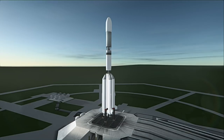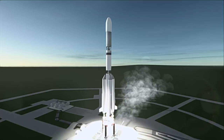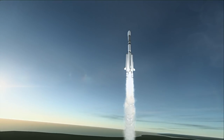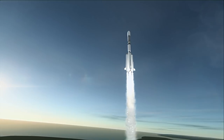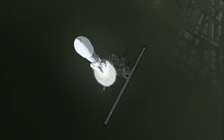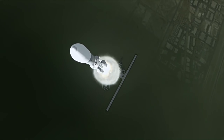The first stage of the Geosynchronous Satellite Launch Vehicle, or GSLV Mark II, consists of a solid rocket motor core surrounded by four liquid-fueled, non-separating boosters. This is a unique configuration where the core burns out but the four boosters continue providing thrust for 50 more seconds, due to the rocket being developed from the PSLV and sharing the same core.